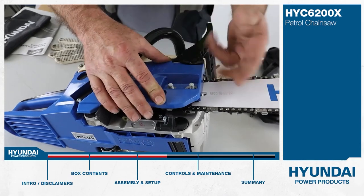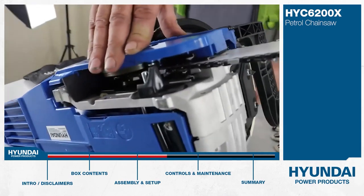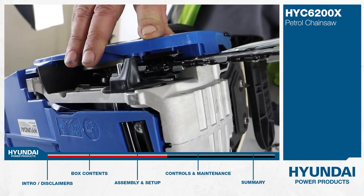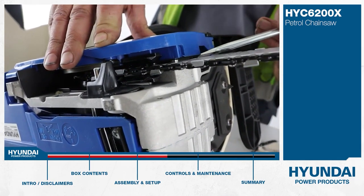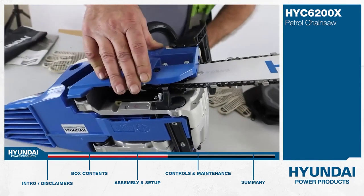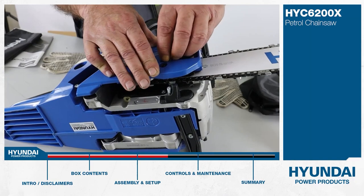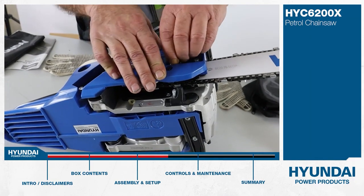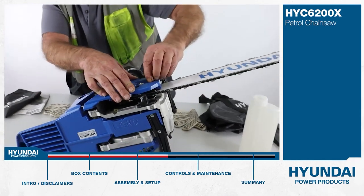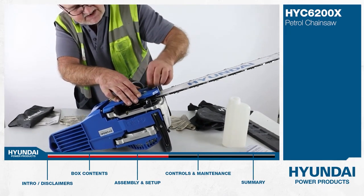There we are. So if you look now, just with hand pressure, you can see, let me use this, that the chain brake will go all the way down against the bar. If it doesn't, you may need to move the alignment of that pin just to get it started. So with that in position, I'll hold it there and just loosely refit the 2 nuts just to clamp it all up in place.